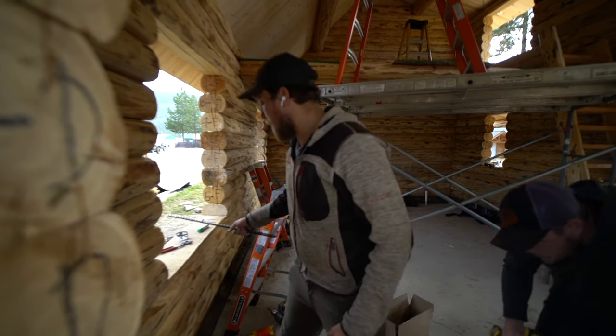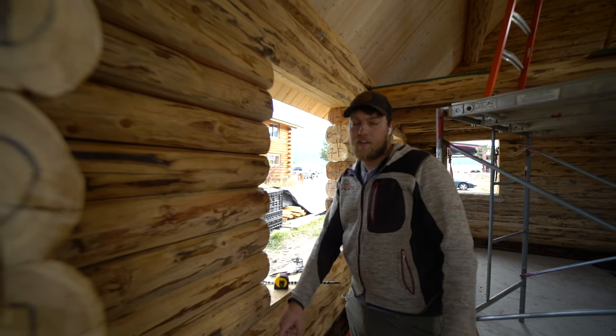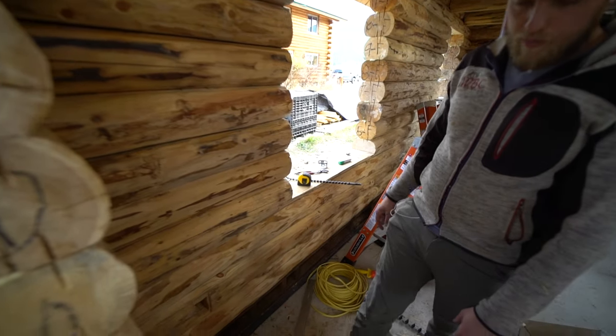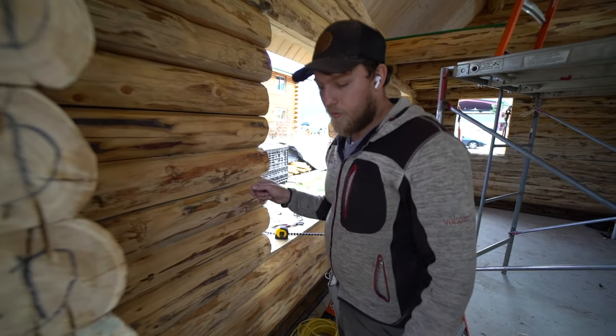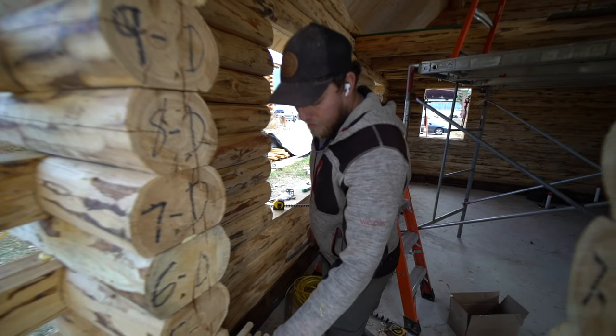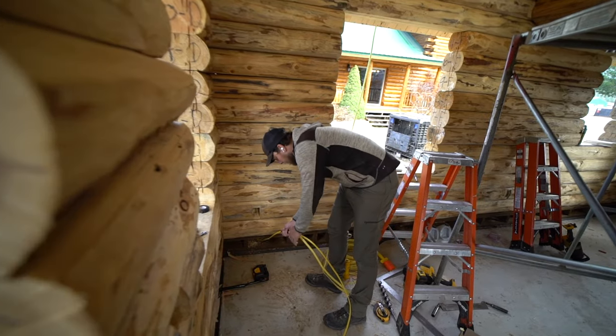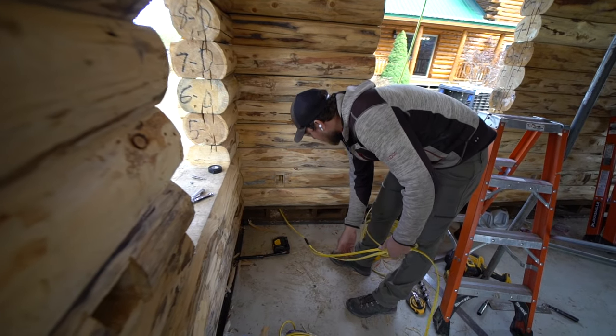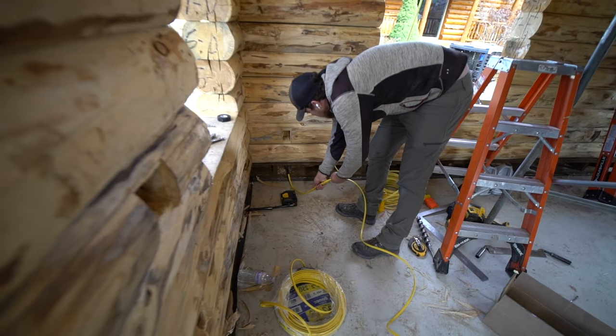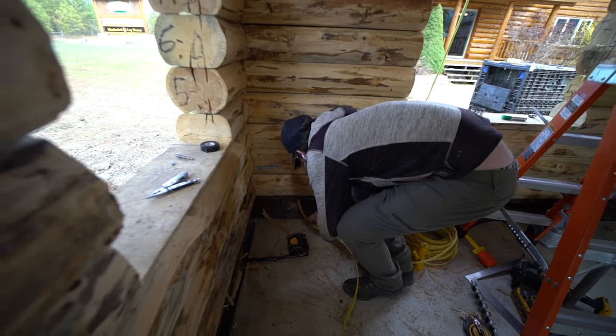And we're gonna pull up. Since we need to pull two wires through this hole, we're gonna use the one we got through to pull up two wires, just because it's a little bit of a pain to get them through, so we'll use the wire as a pull rope. Okay, we duct taped our two wires to this wire here. Okay, go ahead. I'm gonna pull it through. So we have two wires instead of one.